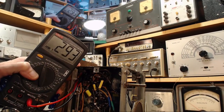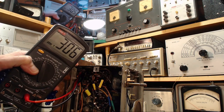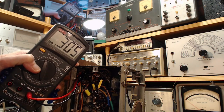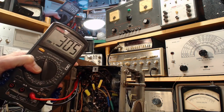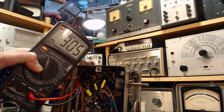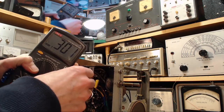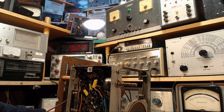Supposed to be 240 and it's coming in at 300. Now, is the reading? Well, first of all, if this resistor was 240, then this meter would read 240 or something less. So this resistor is 300 or something more, because it could be a parallel path. I haven't really thought much about it. What's in parallel with this is a little tiny filter capacitor that I put in the back here. So 300 versus 240. I think I got to change that and make sure it's at 240.